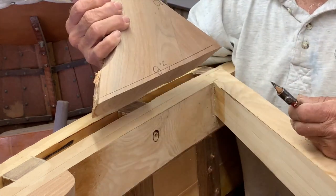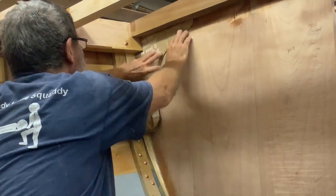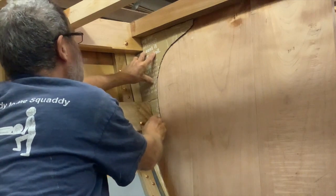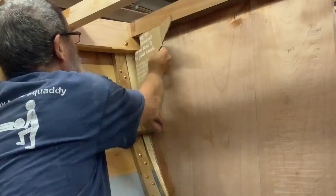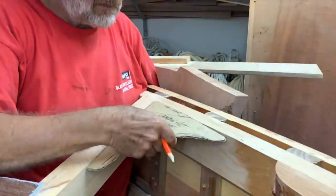Your first move is to make up a template. This can be a plywood or timber template made up to a perfect fit, or simply a cardboard template that's a near perfect fit. Start with the plywood or cardboard well oversized, mark it in pencil, cut to your lines and whittle it down to your satisfaction.